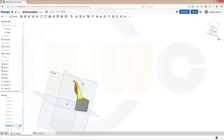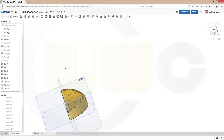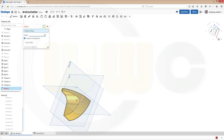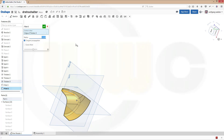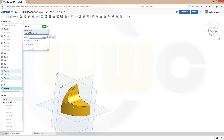Now let's hide the surfaces. Now I can do some fillets. In this case I have to fillet first the inside, so let's go for a fillet — make it 19 right here. Confirm. Another fillet, should be five. Confirm. Now let's make this four, not five. Another fillet right here which should be 20. Confirm. And a five millimeter fillet right here. Confirm.